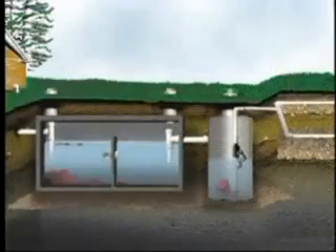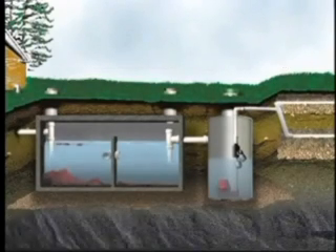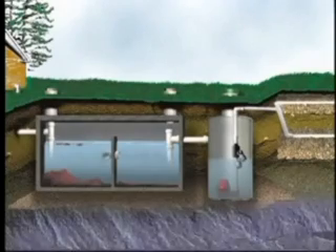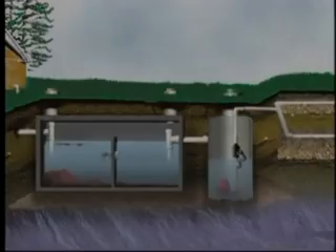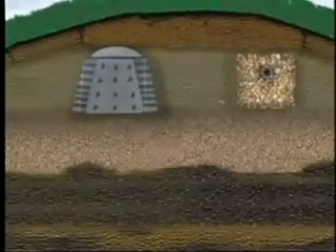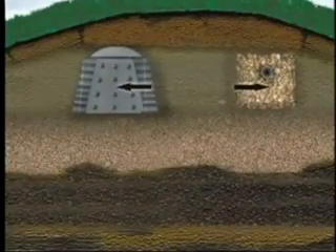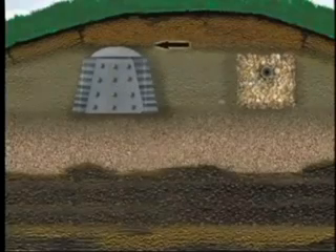This system is generally used to move effluent from a treatment site that sits at a lower elevation than the application site, and in soils with high clay contents. It is also used in shallow soils where seasonal high groundwater and bedrock occur between three to four feet below the soil surface. The system consists of a pump tank and mound land application system. The mound has several layers including permeable fill material, a wastewater distribution system, a sandy loam cap, and topsoil.